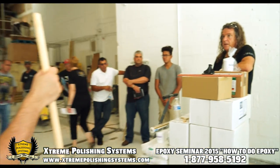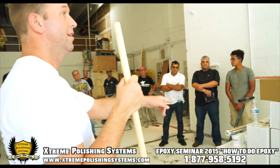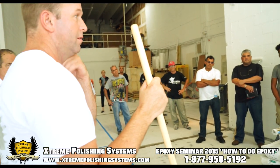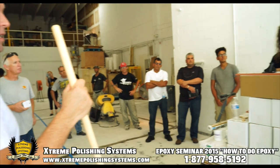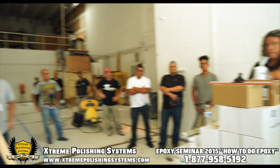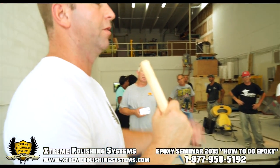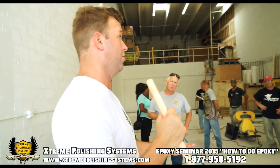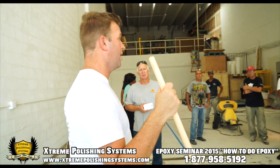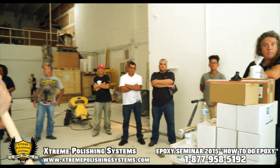So you're better off using as your prime coat, your base coat, 10 mils, one kit. I always go heavier on the middle coat, the chip coat or whatever you want to call it. It's thin on the first coat, thicker on the second coat, because your base coat's more penetrating, and you want that to get into the pores of the concrete so it doesn't delaminate. And your middle coat is what you want to put nice and even and thick so it gives it some build. And then your optional clear coat, you don't have to do, unless they pay for it. You want to do a top, like a poly, something UV resistant, like polyaspartic, polyurea.